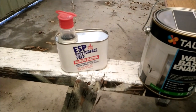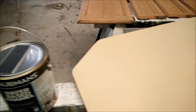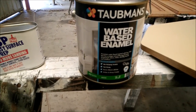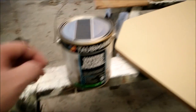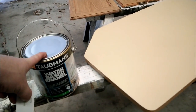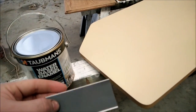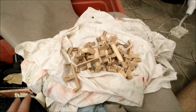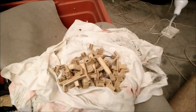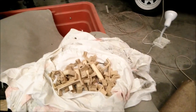Everything's been prepped with this ESP stuff — apparently you don't have to sand the surfaces before, and it's made for timber, veneer, and laminate. On top of that, I'm using a water-based enamel, semi-gloss — a white one for all the cabinets. For the bench tops, I bought the same product but in the neutral and had it tinted to Viking grey. Same deal with all the hardware — pulled it all off, cleaned it down with the ESP using a green scourer, and I'm going to do all the hardware the same colour as the bench tops. So it'll be Viking grey on semi-gloss white.